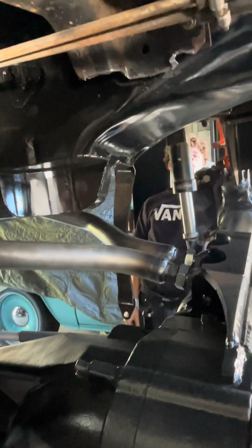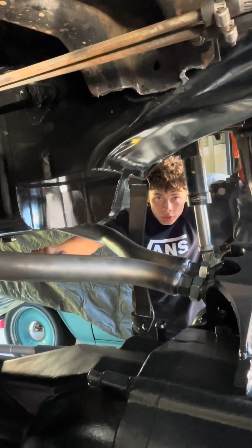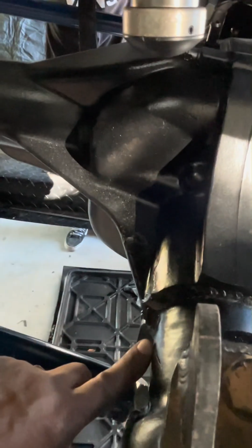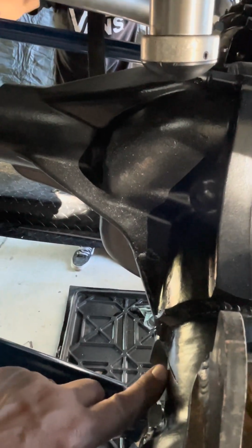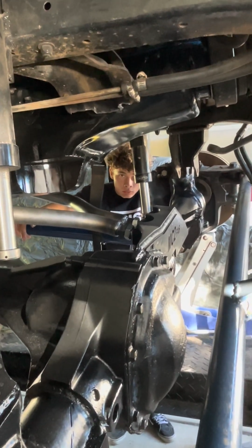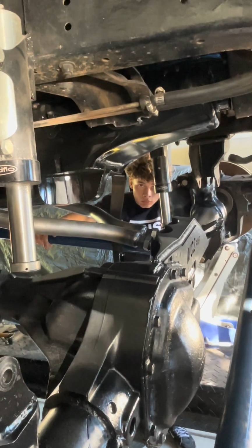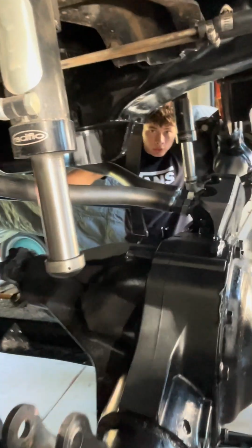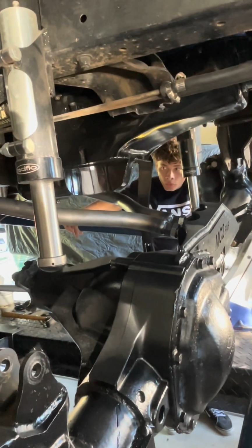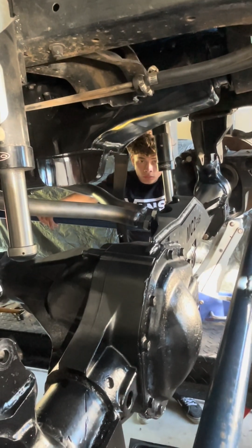What do you think, from ride height, like 4 or 5 inches? Well, it's below these bump stops, and that's where the factory ones were. So it's maybe about right here where it was before. But when he goes to an LS, which he plans to do, the pans are way smaller, and the motors are way shorter. So this will be way higher. We can even go with straight links instead of these bent ones. So that'll help out a ton for the future. But yeah, everything's pretty good.